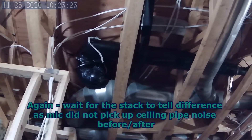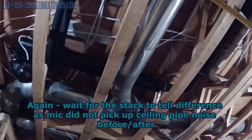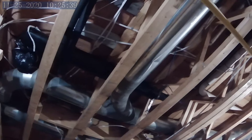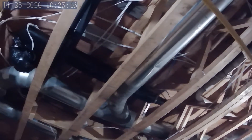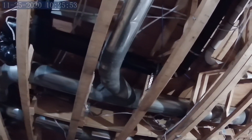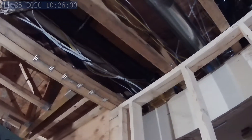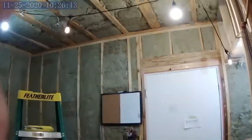It's not an easy product to put on. In the videos, it looks all nice and neat and easy — you can easily access all sides of the pipe. But in reality, you have pipe hangers, interference with ducts, wiring, all that kind of stuff. But it has made a huge difference. I've done the elbow or the trap, and then a length from the trap. I'm probably not going to do the main horizontal pipe — it's quieted down so much everywhere else that I think the ceiling insulation will take care of that. The most significant area is the trap or the vertical.